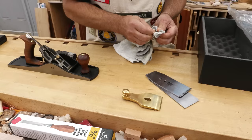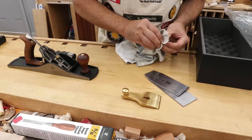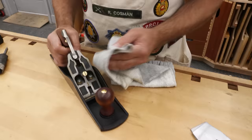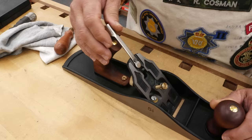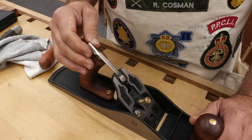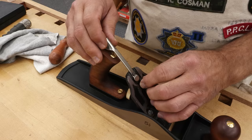Remember this was $220, so that puts it above your standard bench plane you'd find in a hardware store, but on the low side of your premium brands. I'm looking at the lateral adjustment lever and this is always a pet peeve. It's one piece of steel that's just bent. This is a little more robust than some, but it doesn't scream quality at all. I would even put it on the low side of the cheaper versions of a lateral adjustment lever.